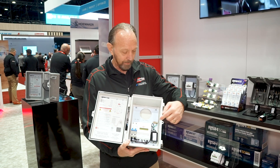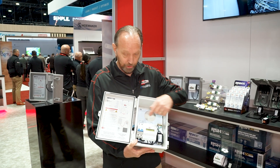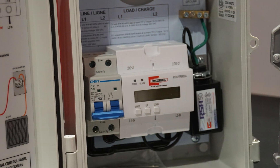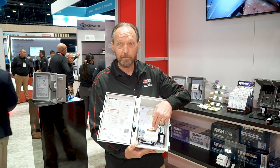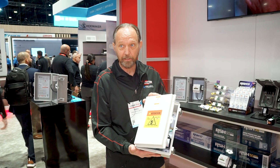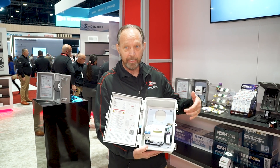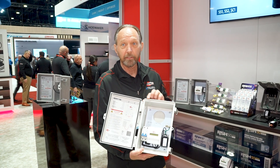All the programming instructions are in the door. We have our surge protection device and high voltage/low voltage monitoring for that high voltage and brownout condition. We've also added a shutoff switch which replaces the service disconnect. In one single enclosure, you have all these components: the disconnect switch, voltage monitoring, surge protection, and a NEMA 3R enclosure. One installation point on the side of your house reduces the number of enclosures and the amount of wiring — it just makes the contractor's life a lot easier. All this stuff is off the shelf and available if it needs to be replaced, not special order, so you never have to take the box off the homeowner's house.